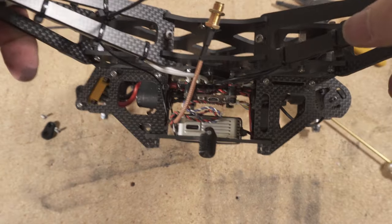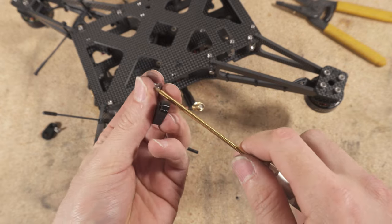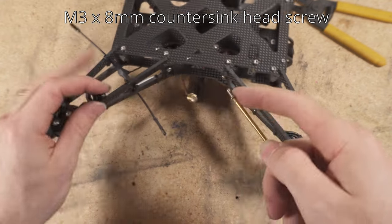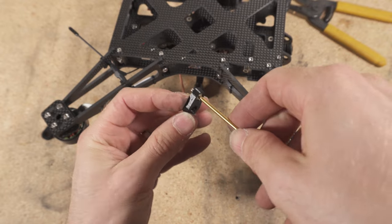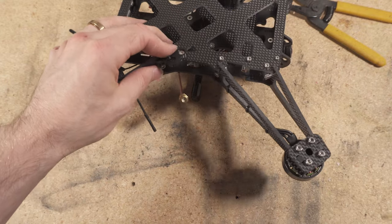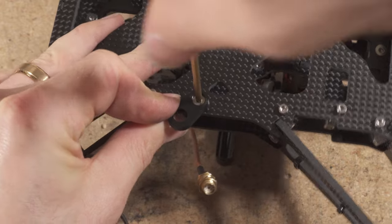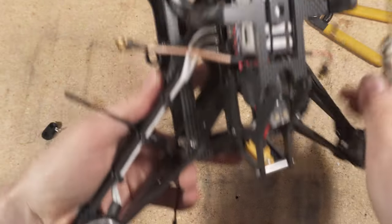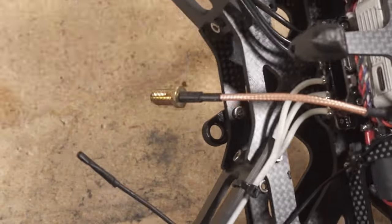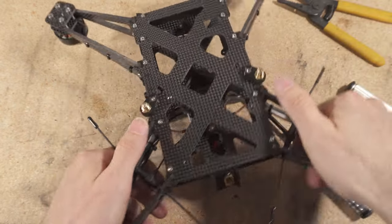If you're using antenna extensions for long range, install the little VTX SMA mounts. They're secured using an 8mm long M3 countersunk screw going in through the side of the mount and screwing directly into press nuts. Screw it in to approximately the right angle, making sure the hexagon portion clears the frame so you can insert the antenna pigtail. This can be tightened with a propeller socket driver.